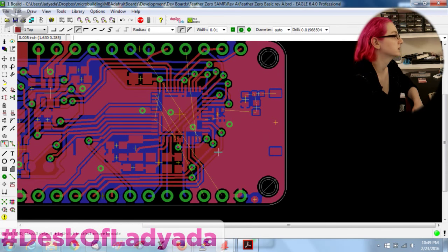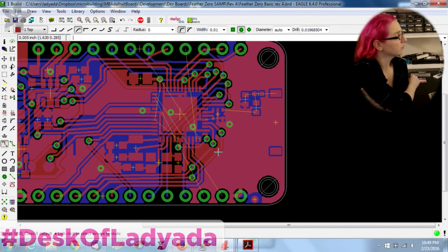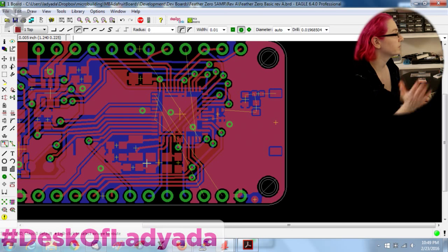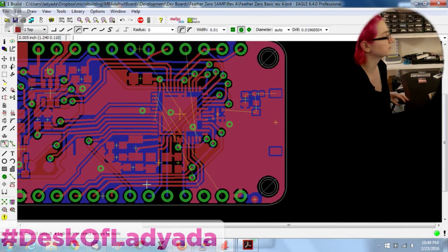I've been doing 45 minutes. I'll keep working on this and probably finish routing it tomorrow morning. Usually I like to take a break and come back — sometimes something pops out at me like, oh, I should have ripped this trace up and I can put four traces through instead. I'm going to try to get rid of as many of these underlying blue air wires as possible by getting them going the other way.